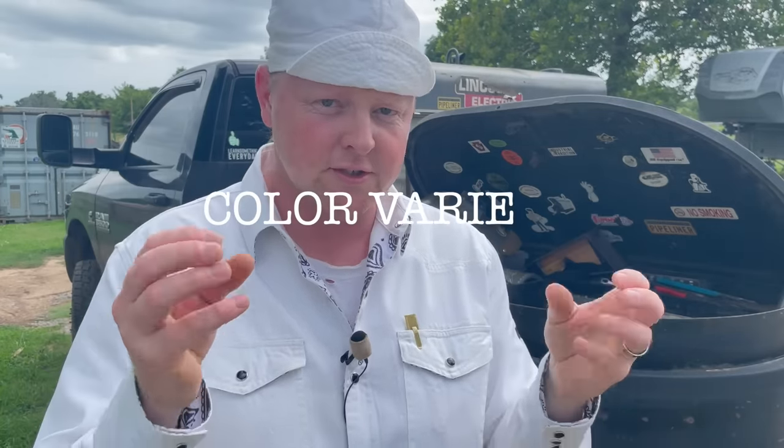Now, it's possible that I'm a little bit outdated on this, so let me know in the comments. The second thing is the variety of colors you can get in a fixed welding lens versus an auto darkening lens. There could be different colors in auto darkening lenses — I haven't researched it — but the couple I've tried have been either green or orange. The latest and greatest I know about is a clear look. With fixed lenses, I've been able to get a blue — a cool-looking blue — and blue looks more clear. The auto darkening clear is better than orange, but the blue really does something to that welding puddle; it just really allows you to see different things in it.